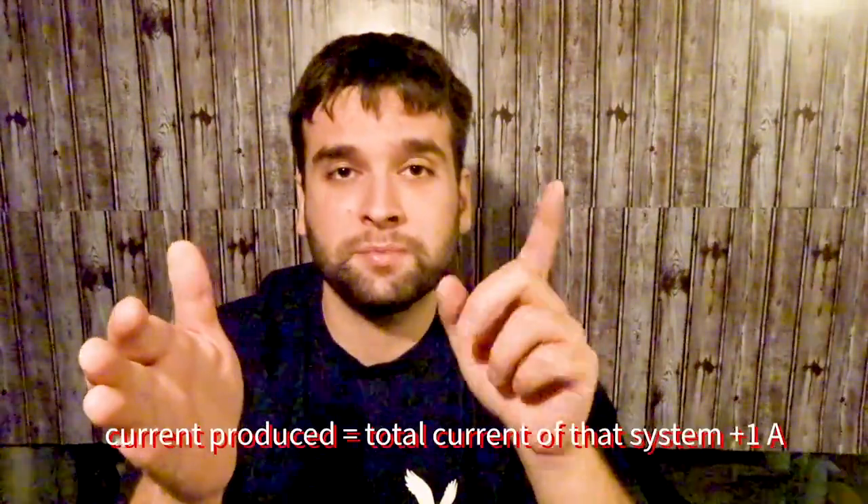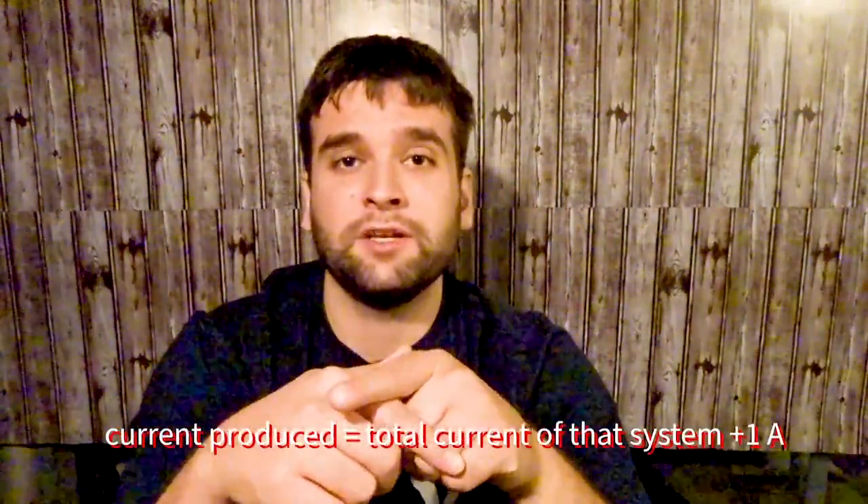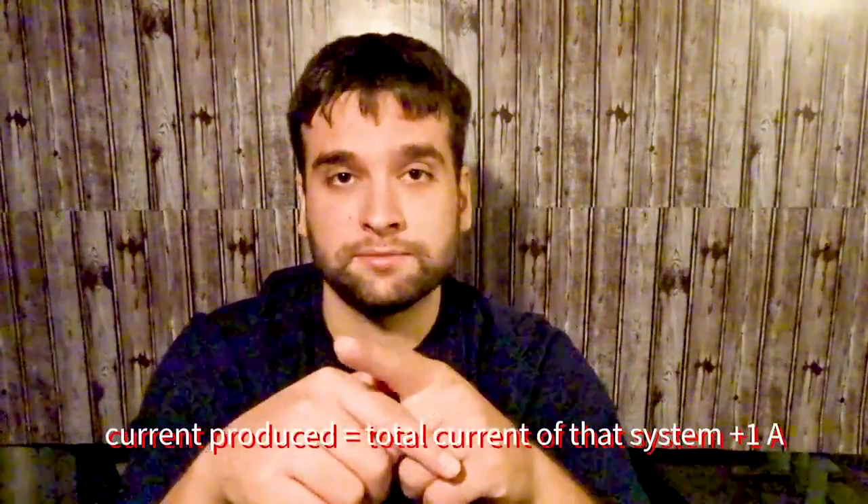I kind of made my own rule now for buck converters: the buck converter's peak output equals the total amperage you need from that buck converter plus 1. I say plus 1 because you need to give yourself a little wiggle room, and buck converters really do need that wiggle room. When working on something like Wolfie, the amperage isn't always consistent — one leg might range from 1.25 all the way up to 3 amps — and those variations play a big factor when using the LM2596, because it cannot produce what you need.